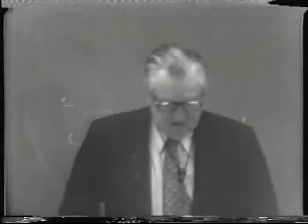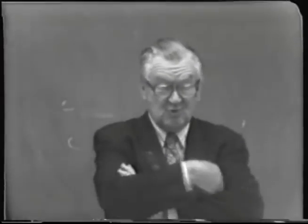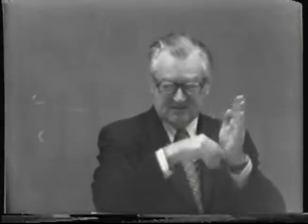Well, I don't think I'll spend much time on mills. As I understand now, the hammer mills are the type generally preferred, although in older days, usually the more simple roller mills or attrition mills were used. You know what an attrition mill is? You know what a roller mill is? Well, a roller mill would be rather simple in concept. There are different designs, of course, but the grain or whatever is to be ground goes between two rolls, or between a roll and some other basin which the roller goes around. Attrition mill, the grain is ground between two plates, one of which is rotating, maybe they're both rotating, but at least one's fixed and one's rotating. They have grooves in it, so the grain is fed into that, and the grinding is by the principle of attrition or rubbing.